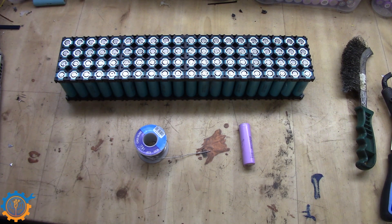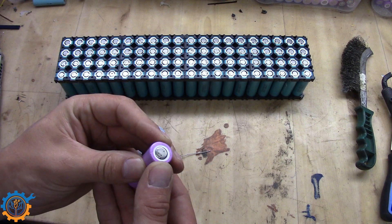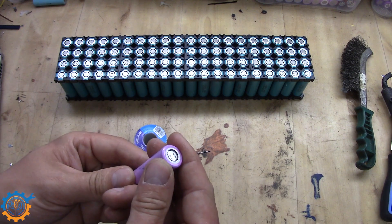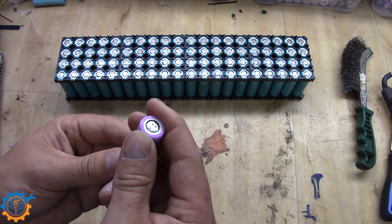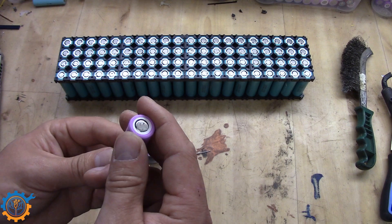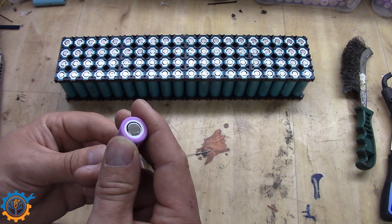Today I will talk a little bit about it, and even though I may not go into too much detail I will try to cover the basics as I'm working with it. First of all, it's important to understand that the positive side differs from the negative side when it comes to soldering. The positive side, due to its construction, does not absorb as much heat as the negative side, meaning you don't need the same amount of heat or time. However, my experience has also been that the positive side is slightly more difficult to solder due to oxides or other issues.